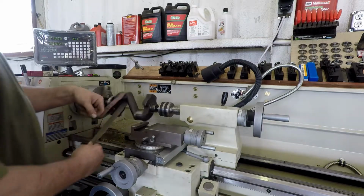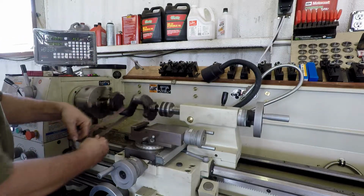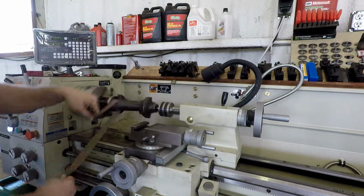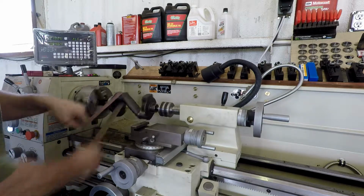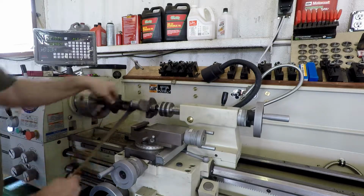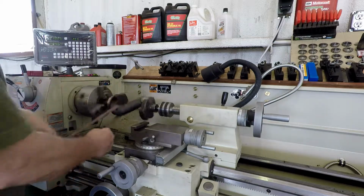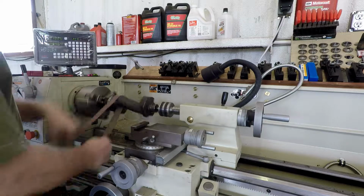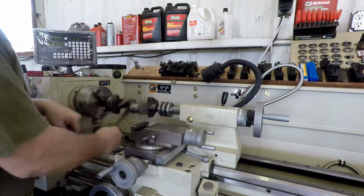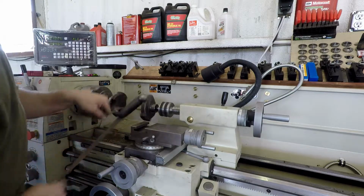Sandpaper's kind of crappy. It ain't really 320 after you run it a minute. It kind of knocks all the stuff off of it, so it's more like polishing now. So you can do this, and it's turning on you, a little better than just sitting in one place and trying to do that. You might flat spot it, but again, this is a compressor. This is not an engine, so it's not like it's running high RPM. You're just pumping air. So as long as it stays together and pumps air, things are nice. When it quits pumping air, things are not so nice.